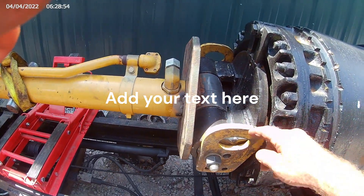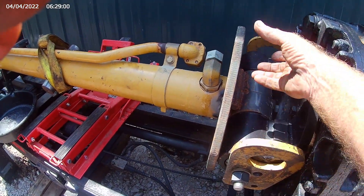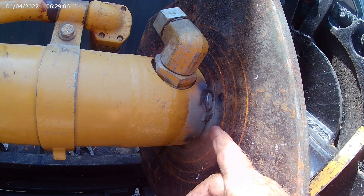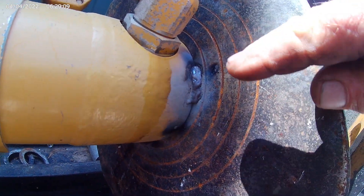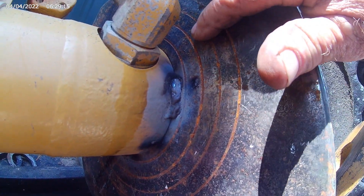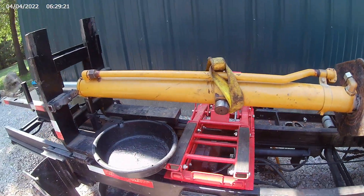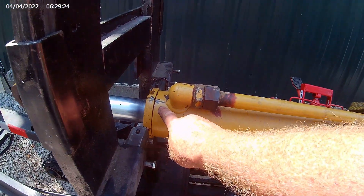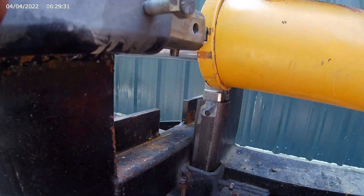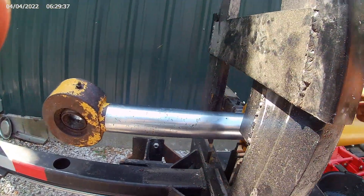I took this plate and pinned it in here with that big piece of aluminum tubing and a solid piece of steel through the inside. We've welded the butt of the cylinder to this plate in three little spots, only about an inch long. You can see where I machined these rings in here to show that we're dead center, so you never miss dead center. On the other end of the cylinder we've marked where it's at, and that's where we'll put it back. You can see my three jaws - one on the bottom - it comes up into the head gland.